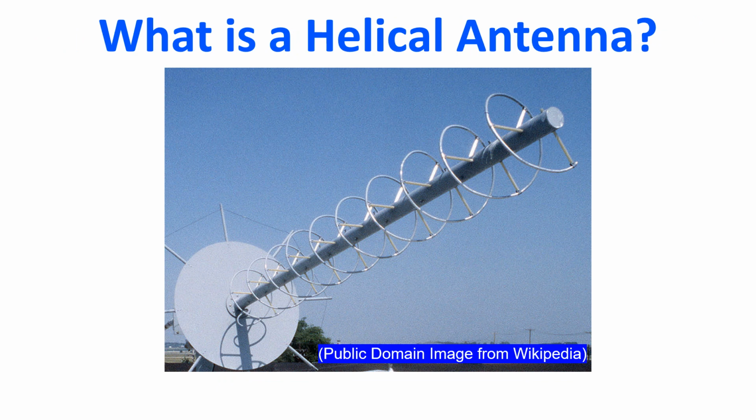Helical antenna, as the name implies, is an antenna in which one or more conducting wires are wound in the form of a helix. It is typically used in VHF and UHF ranges, with the most common example in amateur radio as the rubber ducky of handheld radios. Helix can be found inside the rubber ducky when the outer covering is removed. If the helical antenna is made of a single wire, it is called monofilar, and bifilar if it has 2 wires, and quadrifilar if it has 4 wires.